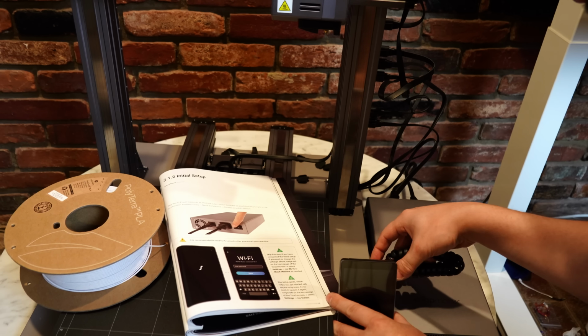All right, here goes. We'll see how fast this thing can go. We cranked up the acceleration, fixed the under extrusion, and we'll just turn those speeds up and see how quickly we can get a Benchy out. That extrusion looks much better. It might actually be over extruding a little bit at this point, but I'd rather have that than under extrusion. Under extrusion makes for wimpy prints. Just look at this. They just fall apart. That's wimpy. We don't want prints like this.